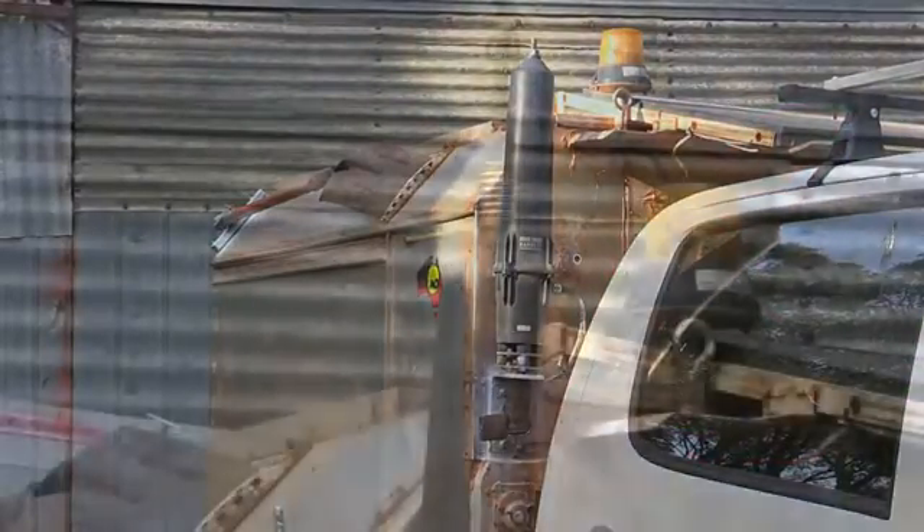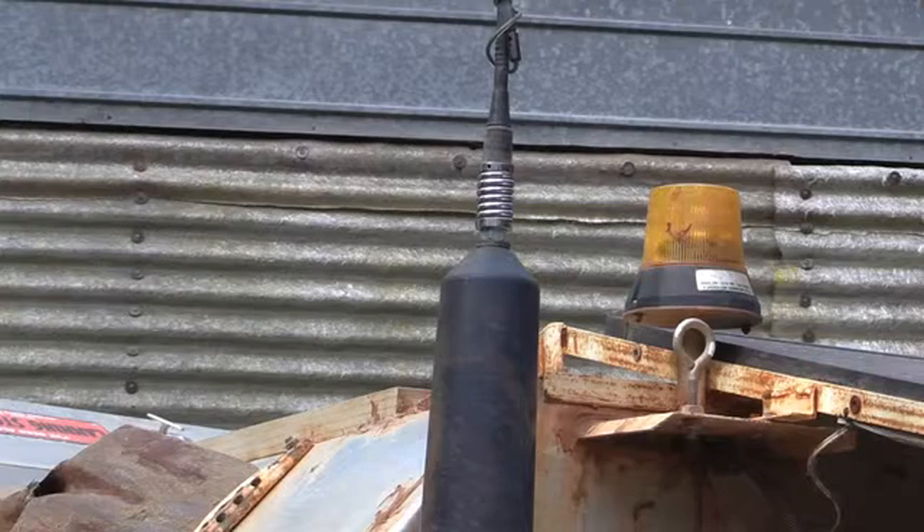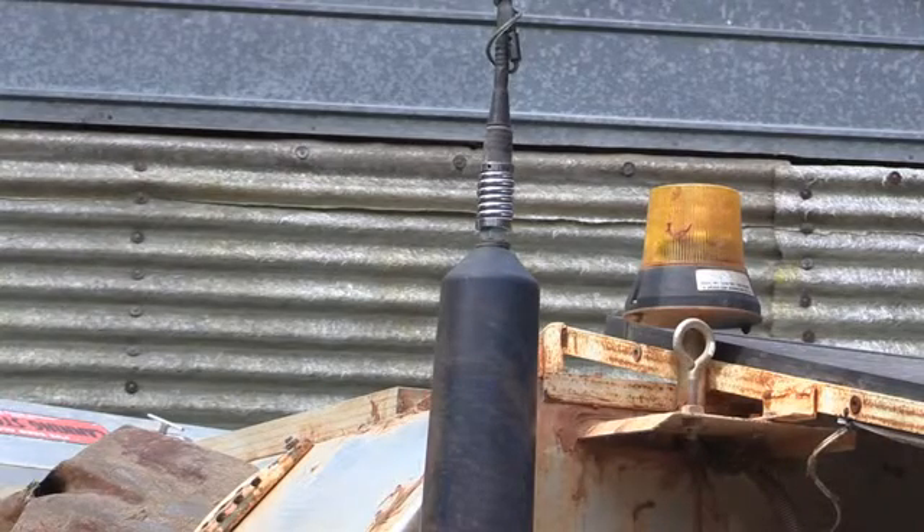I'll show you the mods I'm doing to it. I've got the Barrett antenna back together again with a little bit of copper and that little spring at the top. There's actually a three millimeter gap between the little bale and choke at the top of the tuner and the bolt that comes on the antenna, which goes over that pin. Now I've got a rigid connection — it will be a good electrical connection.